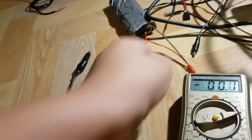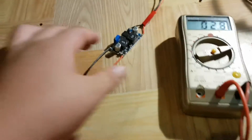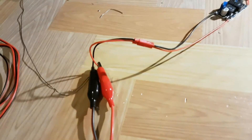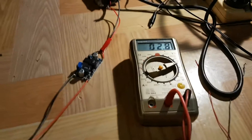The voltage is currently about 7.3 on this battery, so I'm just going to unplug these alligator clips and connect it up to this module. We're back and as you can see I have the battery connected to the module, and here I have my alligator clips connected to my multimeter. We are currently getting 2.8 volts — I have set this to the absolutely lowest it'll go.